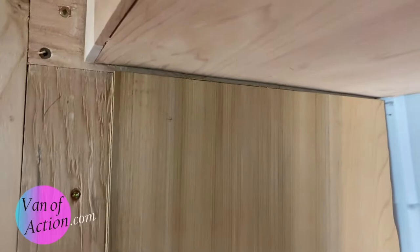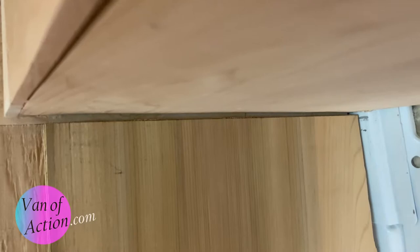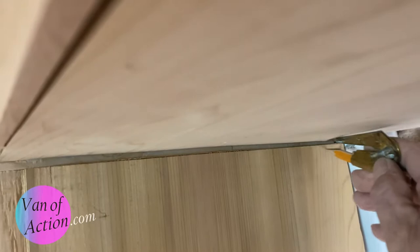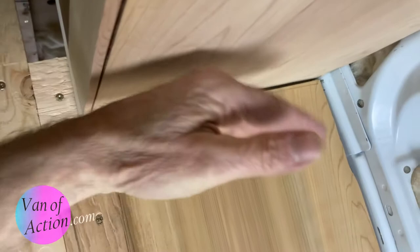So now that is exactly where that panel is going to go. I take my scribing tool — the panel is long, I've made it long intentionally — so I'm going to trim at the top and then cut the bottom off where it suits. Now it's just a matter of taking this scribing tool and that'll be my line. That may not be perfectly straight because I've sanded this surface, so it may be a little bit undulating. I've come down to my table saw bench and workbench to make this cut — I want to show you how we do it.